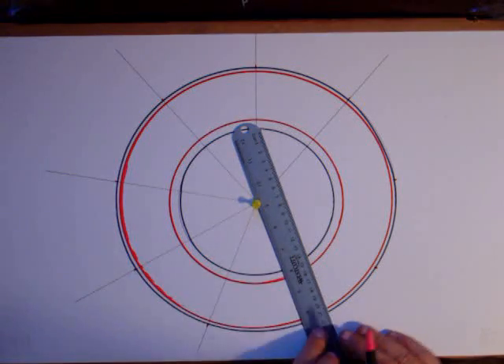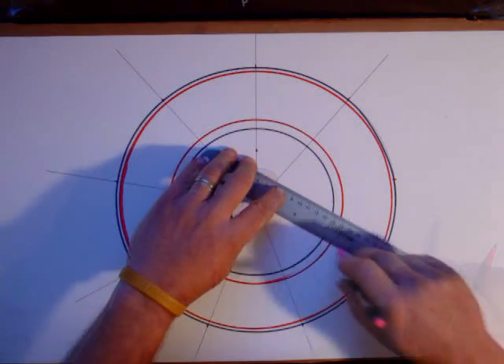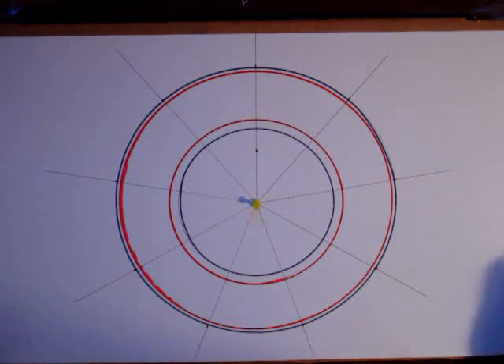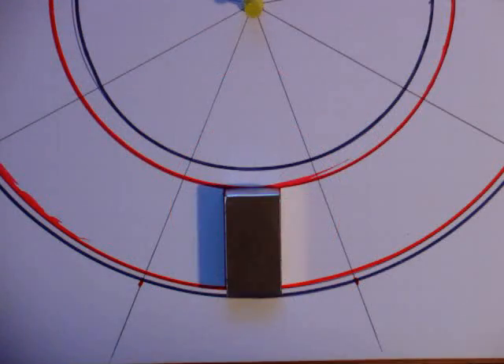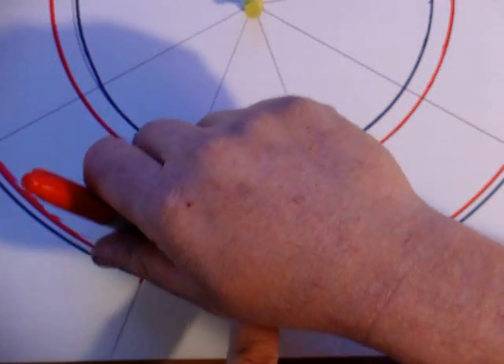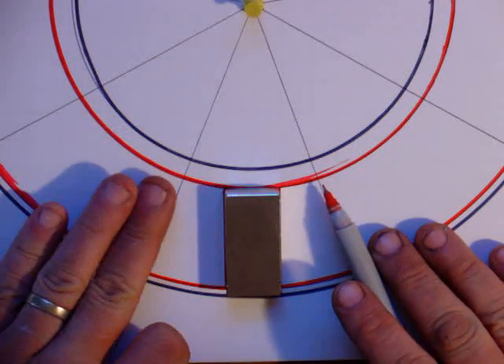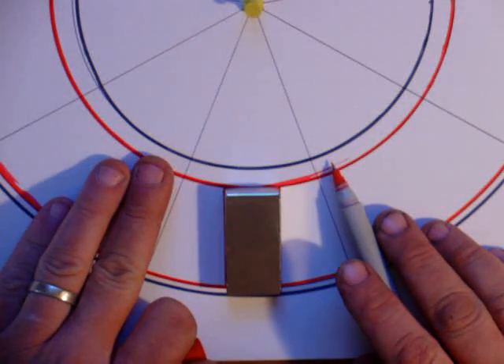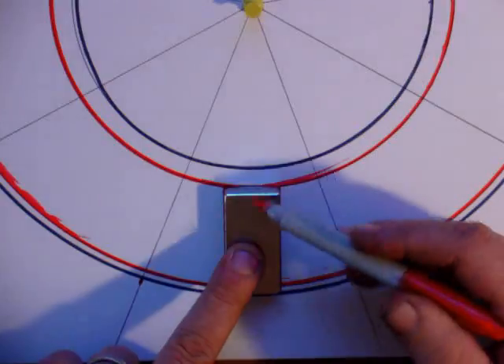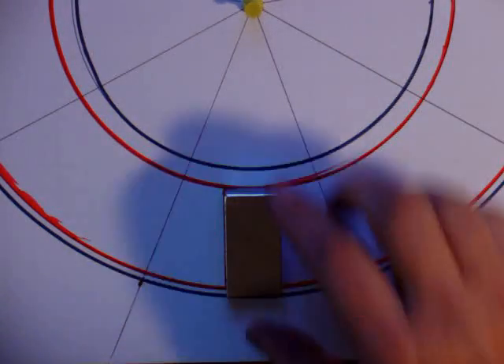Lines have thickness and they make a difference in your measurements. Now we get to draw our coil dimension — for that I have little pieces of 14-gauge wire that I plan on using. I've measured both sides to make sure it's perfectly centered between the lines, and I use a fine-line Sharpie to draw the sides. The lines toward the middle will be adapted because if I wound the coil all the way out here, they wouldn't fit side by side. So it has to be pulled in, cutting some of the magnet shape off, and that gives us the inside dimensions of our coil winder.